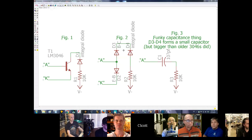So yeah, the AC impedance of these two diodes is causing this one to forward bias, even though this one was reverse biasing. There was an AC component leaking through, screwing up the conduction of the diode, and that stopped the circuit from working. That's it. All right, we figured it out. Good work. Thank you so much to figure out what went wrong a dozen years after it was right.